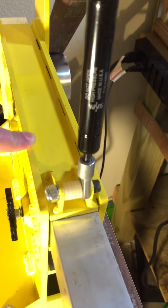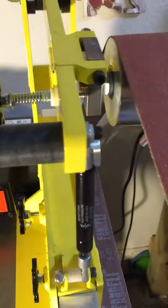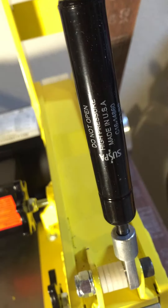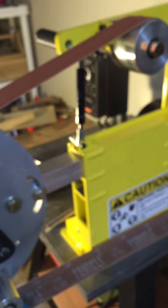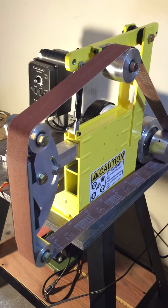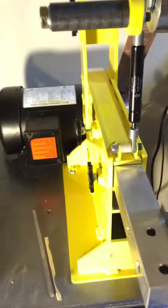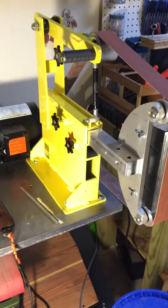You can see it's built out of what looks like quarter-inch or half-inch steel plate, and half-inch up top here. It's got a 20-pound gas spring for belt tension, and all the wheels and everything are included — including the platen. If you have a KMG or a grinder-in-a-box, you can actually buy the wheels, platen, and other parts on eBay for your grinder too, and I highly recommend it — good price and good quality. As you can see, it's bolted down, not going anywhere, no vibration whenever you fire it up.